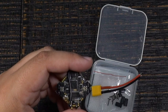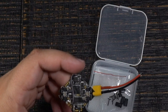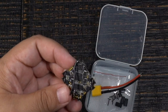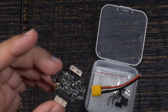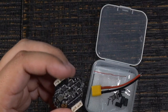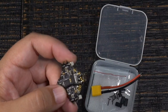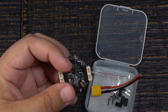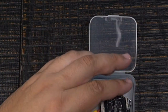I don't like that none of the pads are labeled. Compared to new releases from BetaFPV and Nameless, the layout feels a bit tighter. There's only one 5V output, which is kind of a pain, so I'll probably use the power out from the video transmitter to power the camera. There is a boot button on the side, which is good. This board is about five dollars more expensive than most current models on the market, which I'm not sure why. It should be comfortable at a 10–12 amp burst rating and is rated for 2S to 4S, though I'll probably stick to 3S.